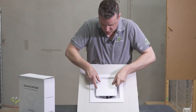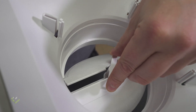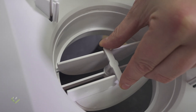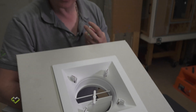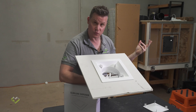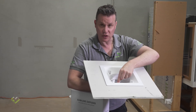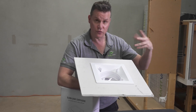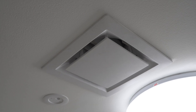You just have to spin this dial. This little unique volume control dial allows you to change how much airflow is allowed through. It's perfect if you want to merge one inline exhaust fan for exhausting a toilet and a bathroom, or two bathrooms. You can commission it depending on the duct runs — controlling how much air goes through and making sure both rooms get exactly the same airflow.